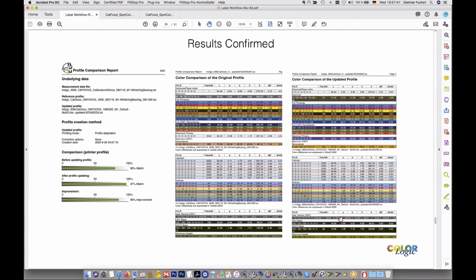It's very detailed. It has many pages. In fact, I've just shown the front pages, which give an overall result. Have we been able to really correct our color back to the baseline? And we look for, in individual patches and in categories, a delta E of 0. Now, obviously, no press is able to produce with that sort of resolution or accuracy. We still have production variance, but what it says is that now we've reduced the variability to just whatever accuracy the press is capable of.